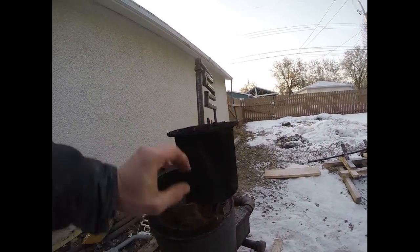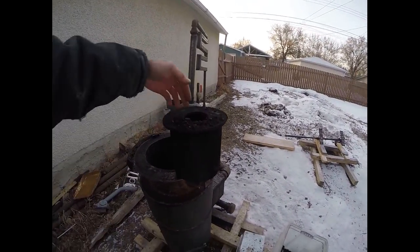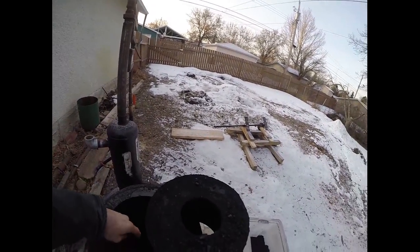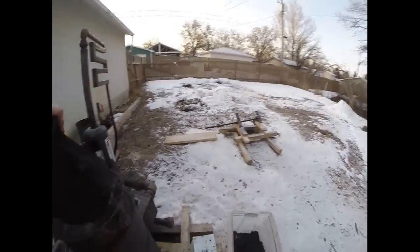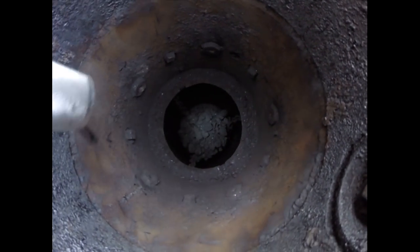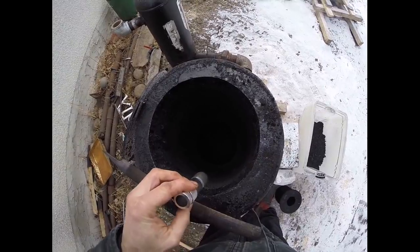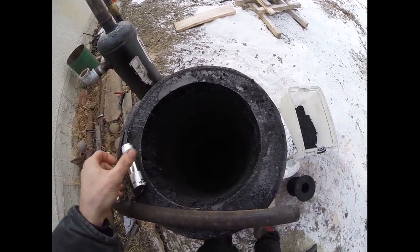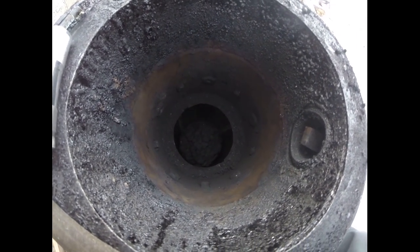What holds all that char up in here is a grate hanging about one inch below this pipe. Before you start it up, you fill this whole bed up with your biochar, and then on top of that you stack your pellets or wood chunks or whatever you're using for fuel. There's my grate — it's just hanging by three chains for now. I wanted to set up a hand-operated system first. You can see when I shake the grate it just goes back and forth.